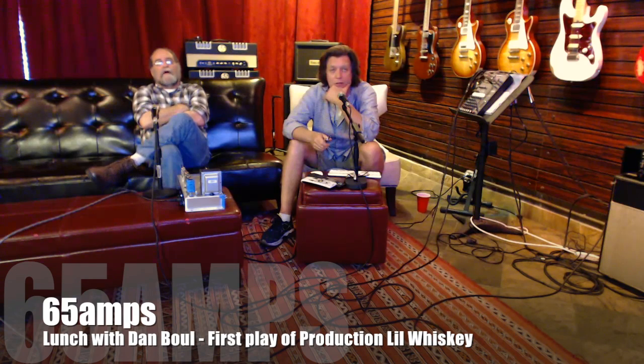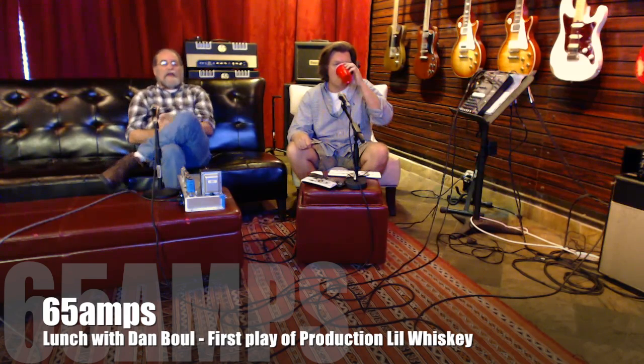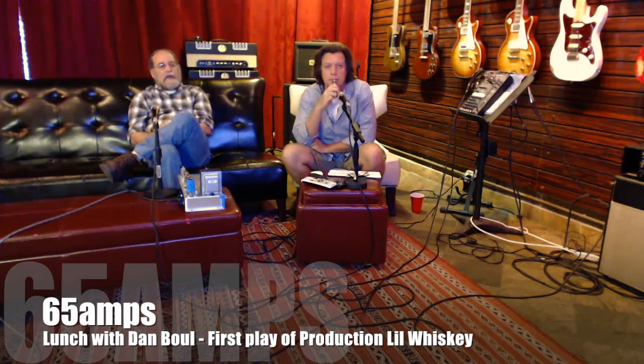V1 on Little Elvis is the closest to the input jack. Yeah, V1 on most amps is always closest to the input jack. Yes, I have played with EL37s, kind of a 6L6 version. An EL37 is kind of like a British 6L6. And I used to run those in a Plexi 50 that was a THD amp, and I ran those for a while in that.